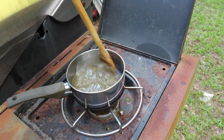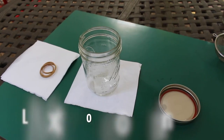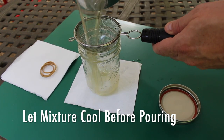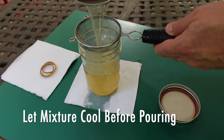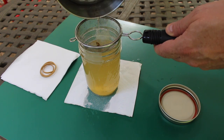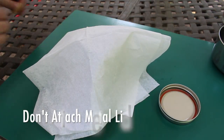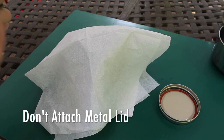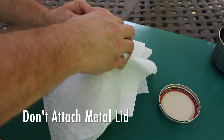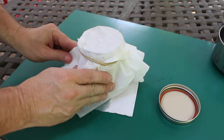Just make sure all the wax is melted — it becomes a clear liquid as you can see here. Next, take the pot off and let it cool a little bit. Then use a small strainer and pour the beeswax mineral oil solution into the 16-ounce jar. Cover the jar with some paper towels or napkins, fasten with a rubber band, and put it away overnight to cool and form into wood butter.